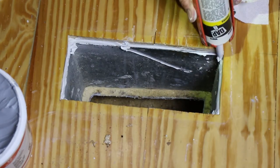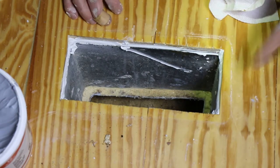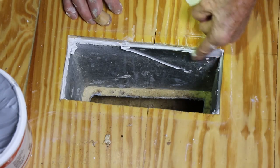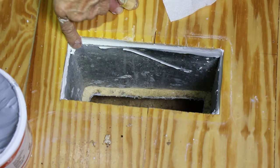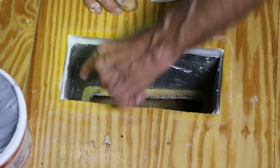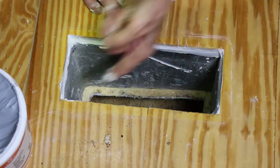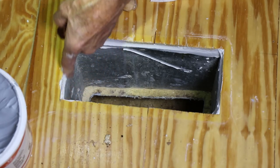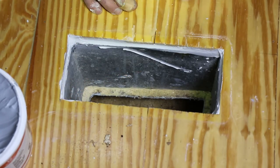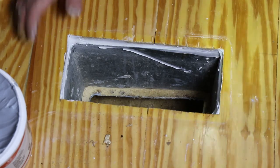Using a clear caulk here is probably the best to use. I use acrylic because it's water-based. And just with the finger, smoothing out that surface, embedding that caulk into that gap, so you have a nice tight seal. This way I'll be able to put that register back on without having it bind up because that opening was made smaller by the caulk that was applied.